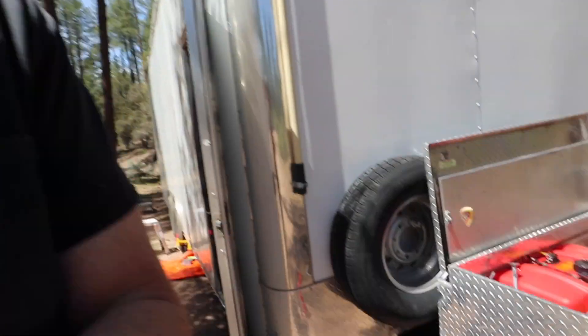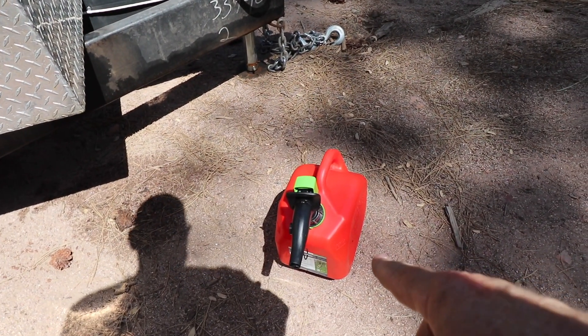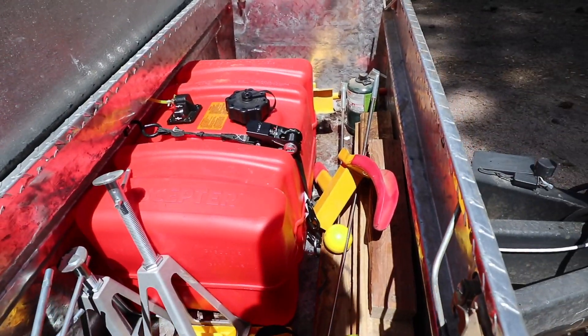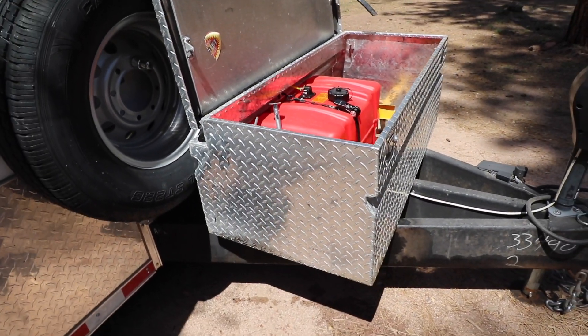The new clip is wired in, hopefully in the correct direction. The next step is to put some fuel in my tank and then prime the pump. I purchased a little two-gallon jug so I can get fuel when I'm in town and fill the tank. This is the fishing boat tank — a 12-gallon tank out here in my aluminum box on the tongue of the trailer. Now it's time to prime the pump to get fuel from the tank outside all the way through the pump and to the heater, and then I can try a first burn.